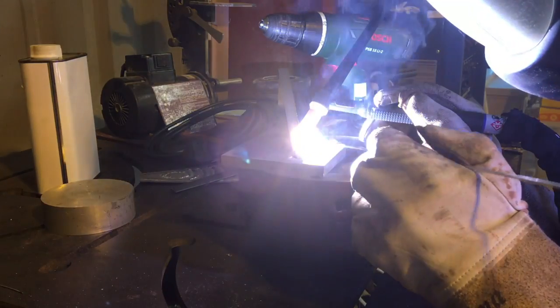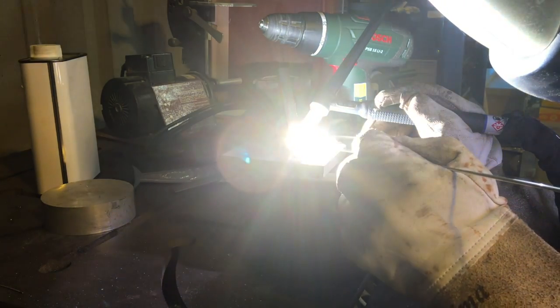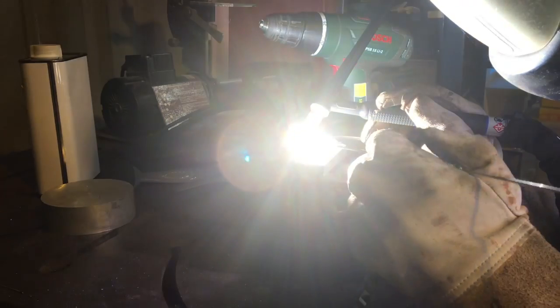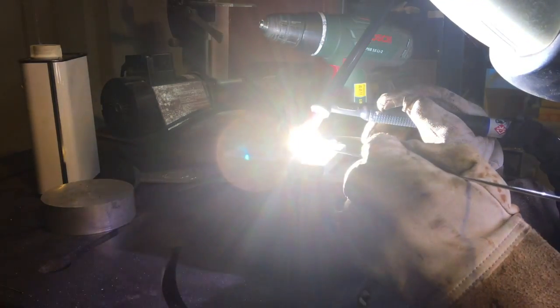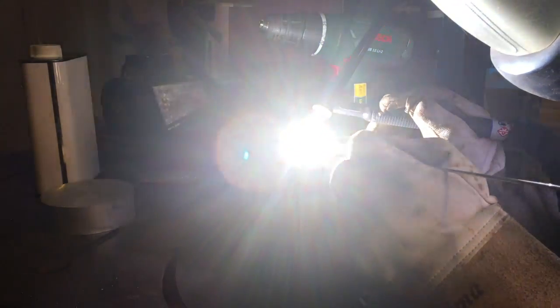because you'll see me in a minute dip. This is going to happen too often. It happens too often to me. It really annoys me. You'll see when we look at the final weld, the two smoky lines where I dipped. So that's something I've got to work on. It's just slightly different technique for thick aluminium and thin other metals. Anyway, I got to the end without ruining too much. And I think it is starting to look just slightly better. So we'll see how it looks.